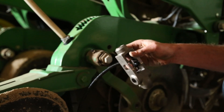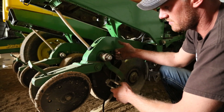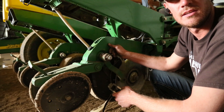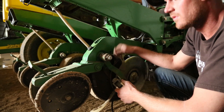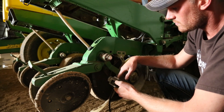We're setting up a two-channel hydraulic downforce on this planter. Initially we're just going to monitor it and see how much pressure we have back on the gauge wheels, hoping to eventually add the hydraulic accumulators to adjust down pressure. For the beginning, we're just going to monitor it on the 1200 in-cab command monitor. These same sensors will be used on the hydraulic downforce.